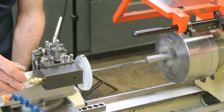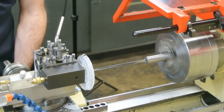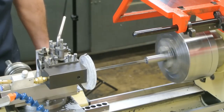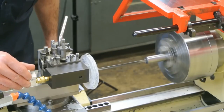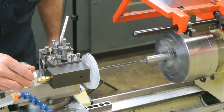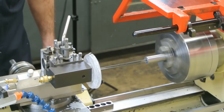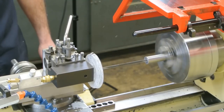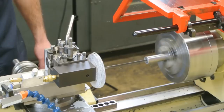As drilling is ongoing, monitor the mist and coolant droplets exiting the hole and adjust the flow using the needle valve attached to the tool holder. At the cutting face, the mist mixture expands, producing a refrigerating effect. The heat from the cutting process evaporates the water content of the cutting fluid, leaving a high lubricity oil. No mist should be evident in the drilling vicinity if this is set up correctly.